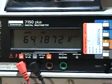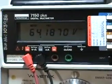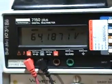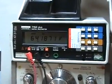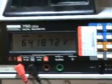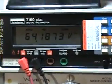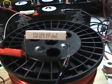What I find interesting is I was getting the same kind of voltage — about 64.187 — with the coil and the resistor on it. The idea is: whatever load the batteries are under, if we can get back to the same voltage, we know both loads are identical. Right now the resistor is direct, and I've adjusted the pulse width to match the voltage from when the coil was operating.